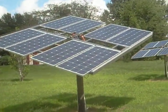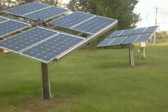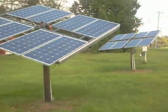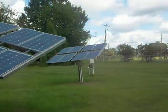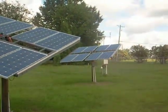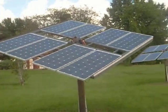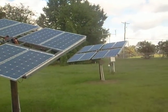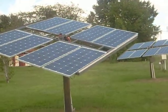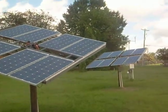There's no type of solar reflector with this system, so each panel needs to be readjusted with the sun — you can see they're starting to tilt. The motors for the tilting angle aren't configured properly; I still need to work on those just a little bit. This one is angled at the proper angle, but that one in the back is not. Tilting the solar panels so they move with the sun can actually increase efficiency anywhere from 10 to about 35 percent.